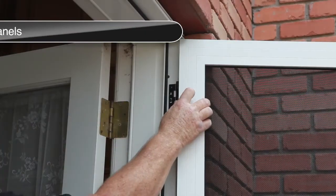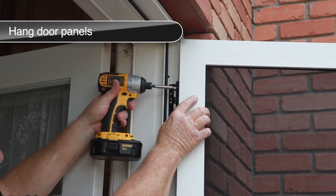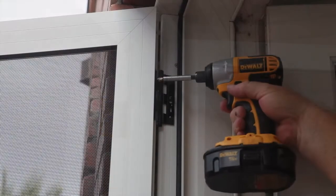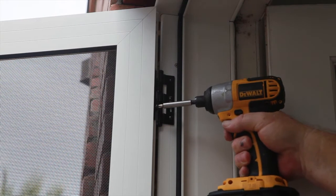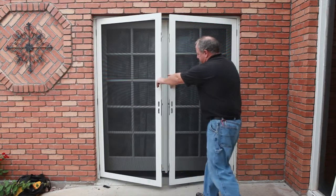With a helper holding the doors in position, hang the door panels onto the jambs by attaching the hinges using the screws provided. It is important that the door panel is held in proper position so the first mounting screw in each hinge is driven straight into the door panel. You will use three screws in each hinge, leaving one hole open for the vault pin. Remove the cardboard throw protector from the edge of each door panel — the door should swing freely.